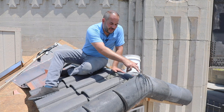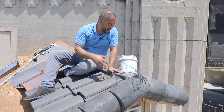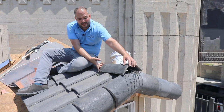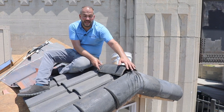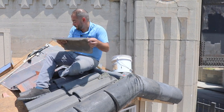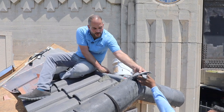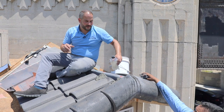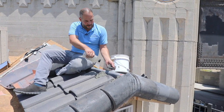This first ridge near the rake piece is probably going to be the most detailed piece. There are two ways of installing this ridge: one is to go on top of the rake; the other is to finish flush with it and mortar this head — I prefer that method. So I have to build this area up with mortar first. Just like any time we use a lot of mortar, we're going to use these broken pieces of tile as a filler, and I'll wet those pieces prior to installing them.